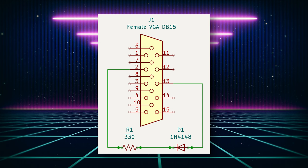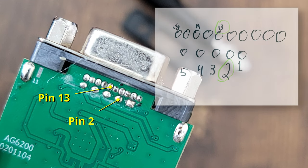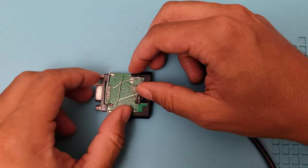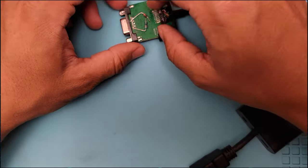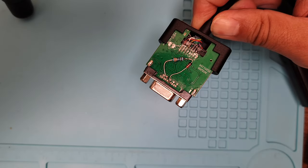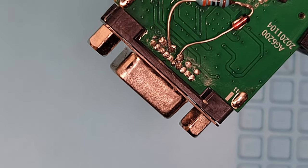I referred to this diagram from the MiSTer FPGA documentation to help me with this. Through my testing, I determined that this one is pin 2 and this one is pin 13. Here's a document I was creating with my tablet to mark what pin is what during the continuity test. The next step is to solder the diode and resistor. I first checked to see how they would fit on the PCB — they definitely needed to be cut down a bit, so I cut them down to a size that would comfortably fit. I thought I recorded myself during the soldering, but it turns out I didn't. I also checked continuity to make sure I didn't bridge any points.